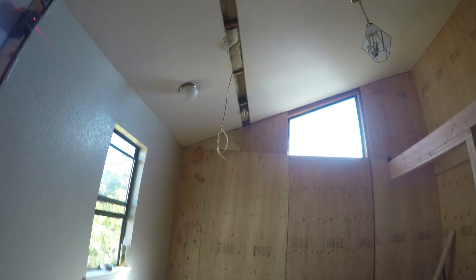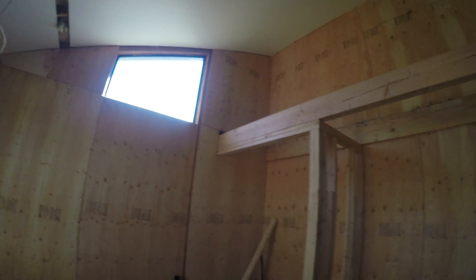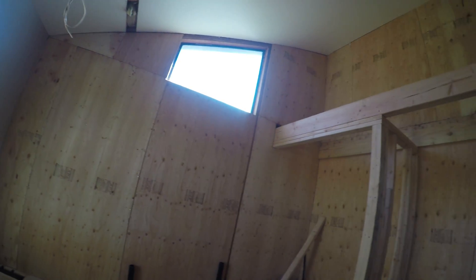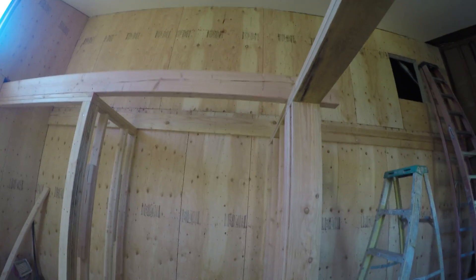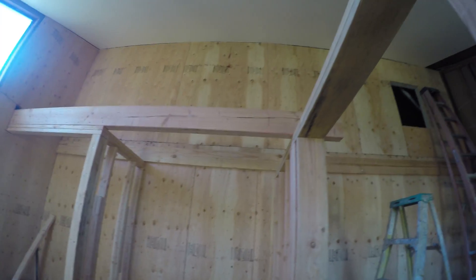So when we opened all the drywall, we put plywood on all the exterior walls — this is the correct way to do it. You have all the beautiful plywood. We spent a lot of labor and materials just trying to reinforce all the earthquake shear walls. There's also a big wall right in the middle of the house — a major shear and load transfer location — and there was no shear wall at all. This is horrible.